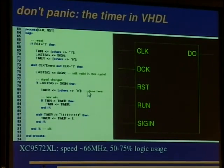And this timer value here isn't applied now. It is applied after the run of this process. This way I can write this here, and the timer value is still valid and not 0. Okay, that's just a bit of VHDL fiddling, just to give you a short idea. And we also want to protect our timer against overruns, because we would get wrong results then. So this is a saturation timer.